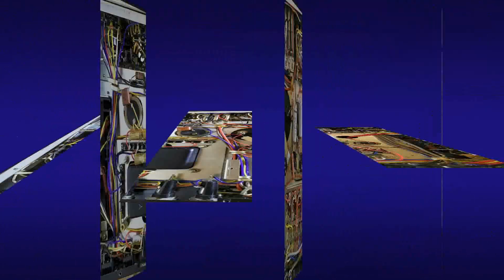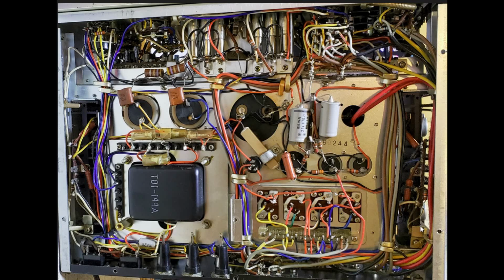I just wanted to spend a few seconds to show you the underside of the KA-6000. And probably the one thing to point out is this is a connector where the main driver board for the output transistors resides. And there are your switches. These have the resistors, your tone and treble switches, so that's right over here. And that's what it looked like.